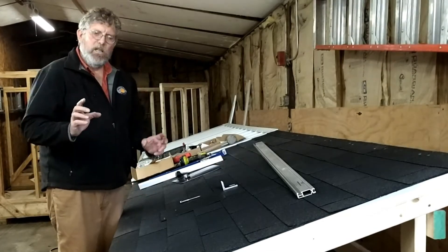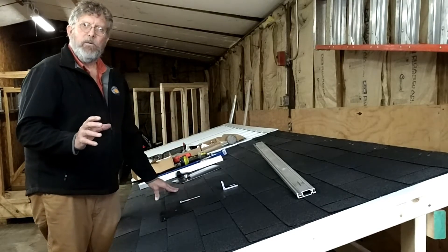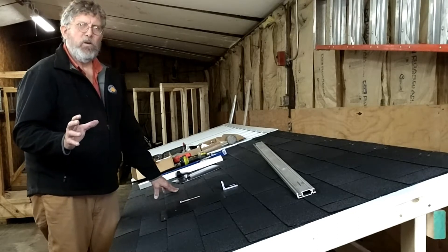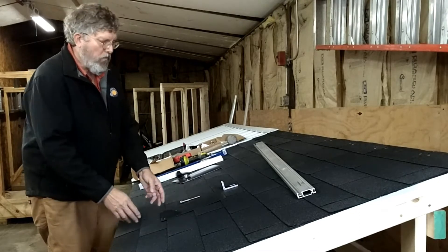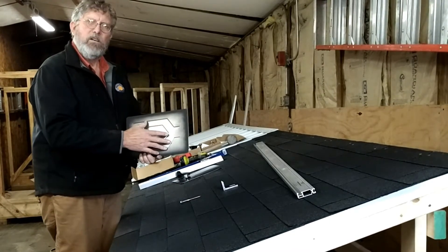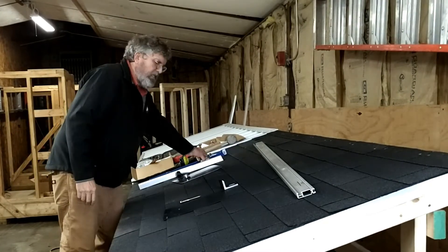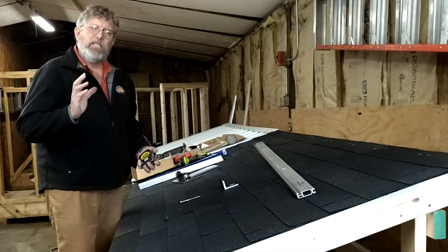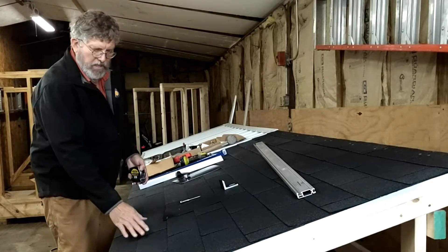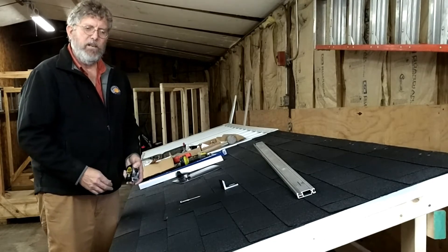The first thing we're going to have to do is locate where the rafters are on the roof. This is never a simple project, and you're going to miss occasionally — that's why you're going to have tubes of caulk with you to fix all of your mistakes. The nice thing about the size of the flashing is it covers over a myriad of mistakes. Typically you'll have a stud finder, but you may not be able to use that on the job because there are a lot of nails within the roof that are going to disorient any magnetic stud finder.